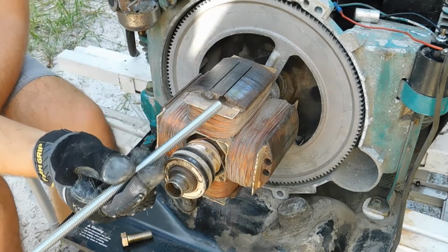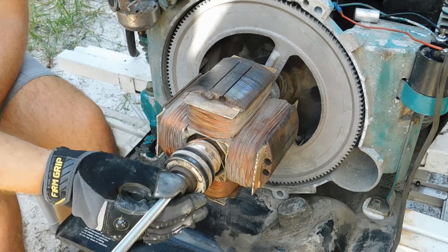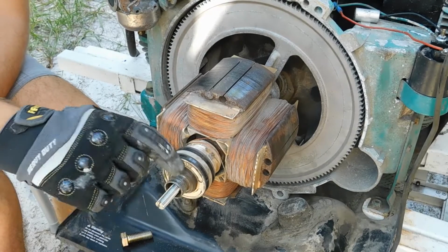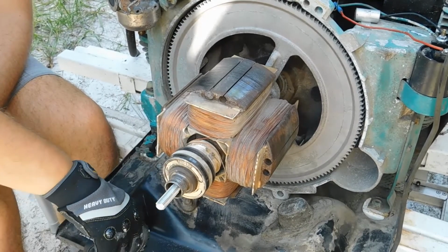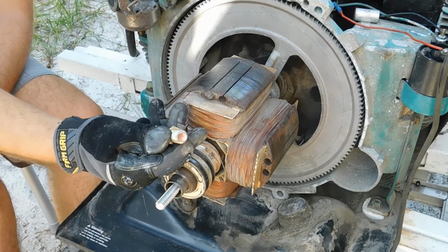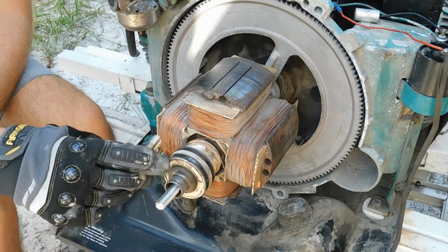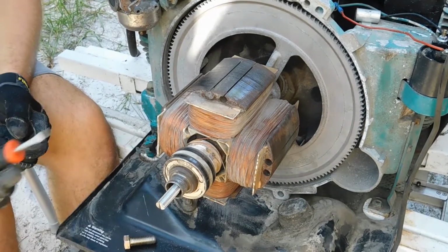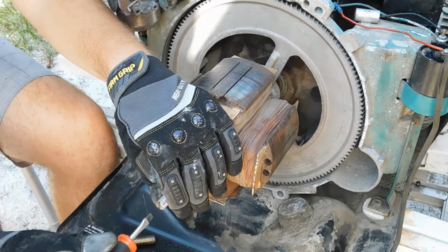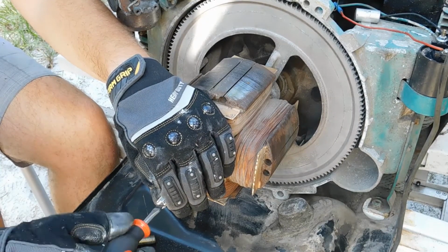The reason I'm doing this is to seat this down inside of here where the original bolt came out so that it can be my anchor mount to push on with this 9/16 by 12 cap screw that I'm going to put behind it. The reason I notched it is so that I can take this screwdriver, and when I seat it all the way in there where you won't be able to see it, I'm going to turn it with the screwdriver to tighten it down.